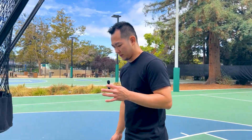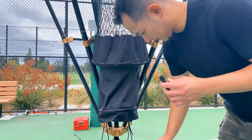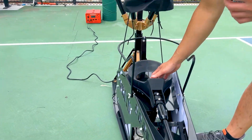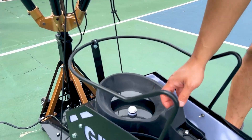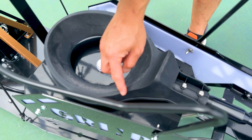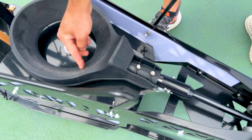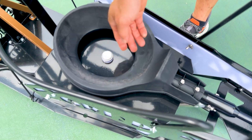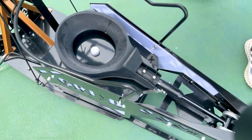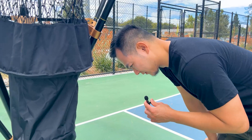We only put our thumbprints on mechanical parts. One of the parts they were experiencing repetitive failure with was this plastic arm, or this plastic claw catch. What was happening was they were vacuum forming it, and there was so much impact after the impulse that the plastic parts were just cracking, and then the crack would propagate. Finally, after so many shots, it would just fail catastrophically.